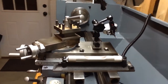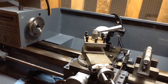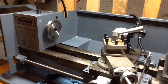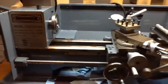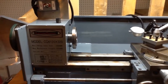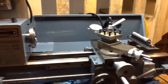The next step: I got some test bars — a number three Morse taper test bar for the headstock and a number two Morse taper test bar for the tailstock. I'll probably get those measurements done tomorrow. I think the replacement tailstock I bought from Harbor Freight is a few thousandths too high. One thou or so is acceptable since the tool droops slightly, but anything more will need adjustment — either shimming the headstock up or machining some off the tailstock.